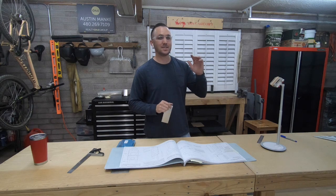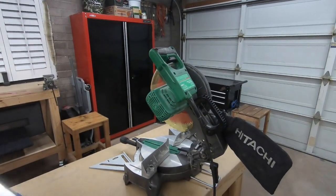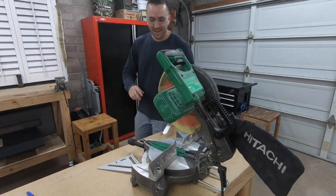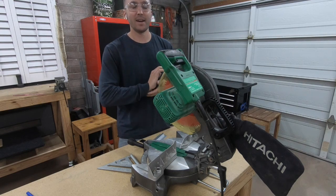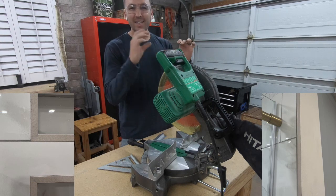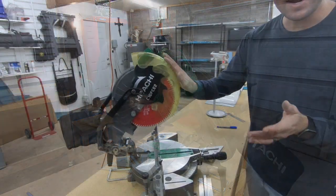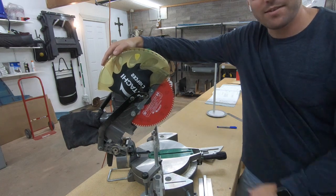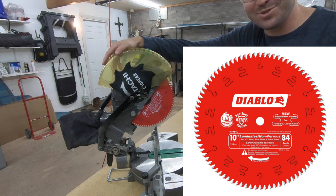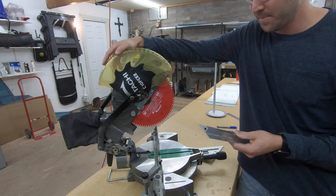One thing I wanted to mention quickly — you're about to see a circular saw being used for the first time. I made a pretty interesting discovery. Like I mentioned in the previous video, I did a whole lot of work on the inside of the house involving tile work. Part of that involved aluminum Schluter edge profiles around the shower niche. The way to cut it that I found tile guys mentioning online is using a saw blade meant for aluminum — about 40 bucks at Home Depot or Lowe's — and it works really well for aluminum, and also really well for these parts here.